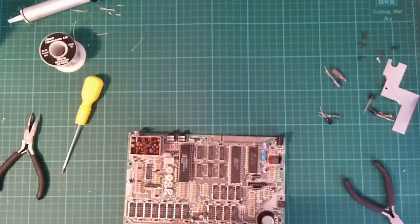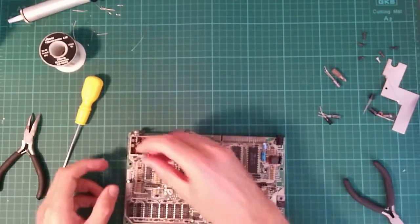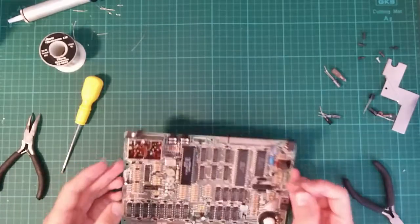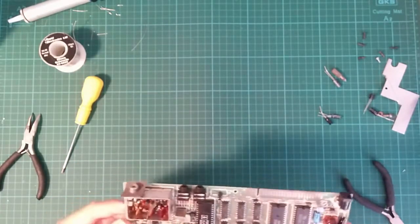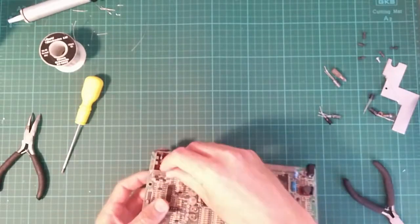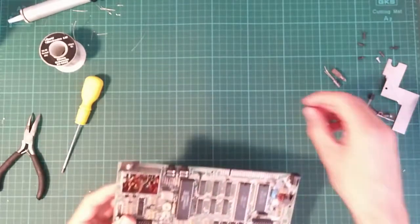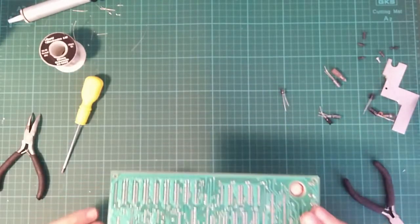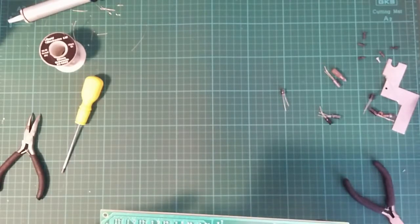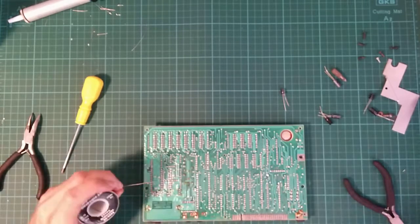Oh God, yes. Right. So here we have another 22 microfarad capacitor, and it's just going to have to spider in over the top to clear those holes. Yeah, it's just going to balance in standing on its legs. It'll keep it reasonably out of the way of the other components. Shouldn't actually be too bad. But yeah, I've got to clear those two holes. Apply solder, remove solder.